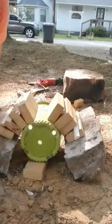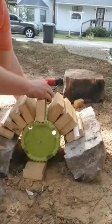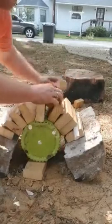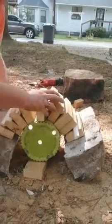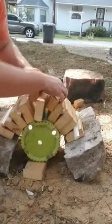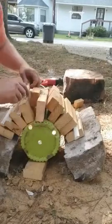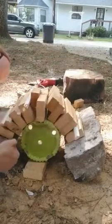Shim, block, and now we come to our capstones. These ones we want to be perfectly vertical, and we just shim in whatever we need remaining. We use a little bit wider shims for mortar, like this. Okay, and we'll shim in there like that. So now we have this bridge of these.